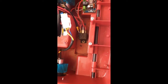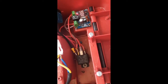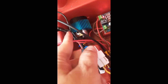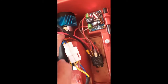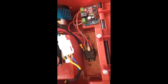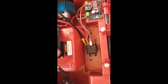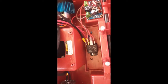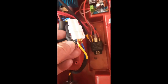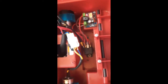I'll put a picture of the board and a schematic — that should help you guys figure out the wiring. It's not too crazy as you can see here. On the McQueen, the thin black and the thin red go to the main harness for the pedal. Yellow and blue are the motors, and then this double connector here is to the front of the car for the pedals. There you go, I hope it helps.